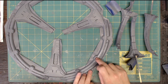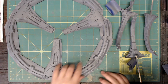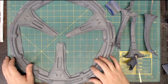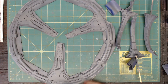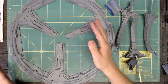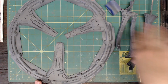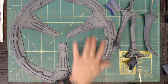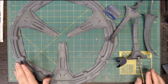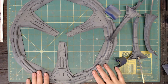And then this one right here, it sunk in just a little bit. But again, it's probably not ever going to really be great until I get everything situated. So we're going to go ahead and continue with this and do our base coat. But first, it needs a light sanding. So I'm going to get some of that double aught steel wool and sand over all three of these pylons and this, and get them nice and clean and ready. Get the surface ready for the base coat.